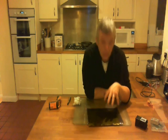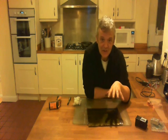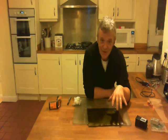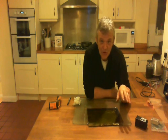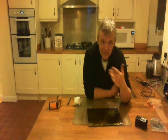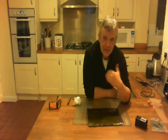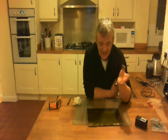The reason it's quite cool is because there are no binders in this — it's just been applied as a graphene layer. No glue, no binders, nothing. It sticks really well. Having no binders means there's nothing to crack, burn away, or break. We can flex it as much as we like, but clearly we have to do some testing on that — flex it many, many times and make sure it still runs despite having something like 10,000 flexes or something like that.